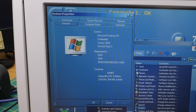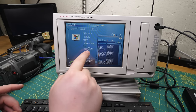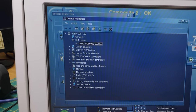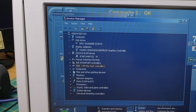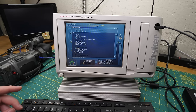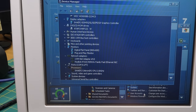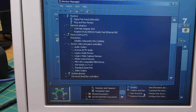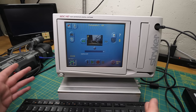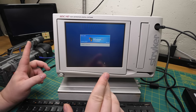There's not much else going on in the control panel - just a sound card driver, that's about it. Let's go into services. I think if the Windows Enhanced Write Filter was in use we would see a service called 'enhanced write filter', so I think they just split up the drive into partitions for convenience when re-imaging. As for the actual system hardware, this thing is running a Celeron 2.0 - that's a P4-class chip - with 504 MB of RAM. Then we just have the 80-gig hard drive, basic onboard Intel 82845 graphics. That is in fact a DVD burner. This display here is only 800x600, which sucks - kind of limits what I can ever do with it. Built-in 10/100 ethernet, single processor, no hyper-threading. Then we just have the built-in AC97 audio, and that's it. Very bare-bones machine.